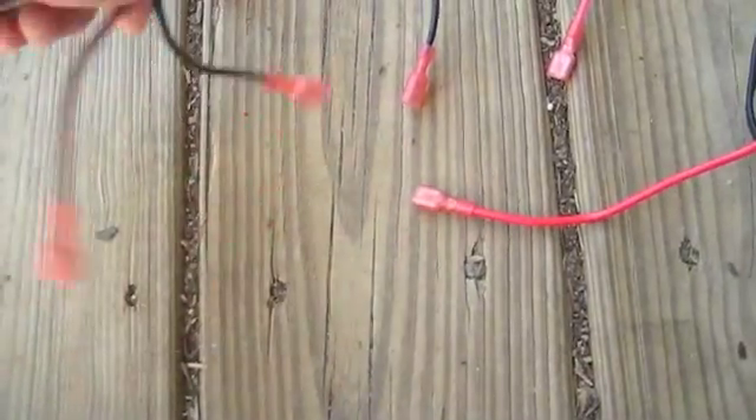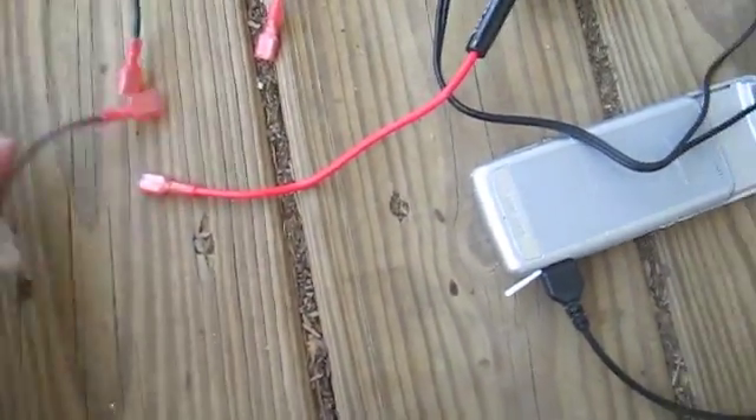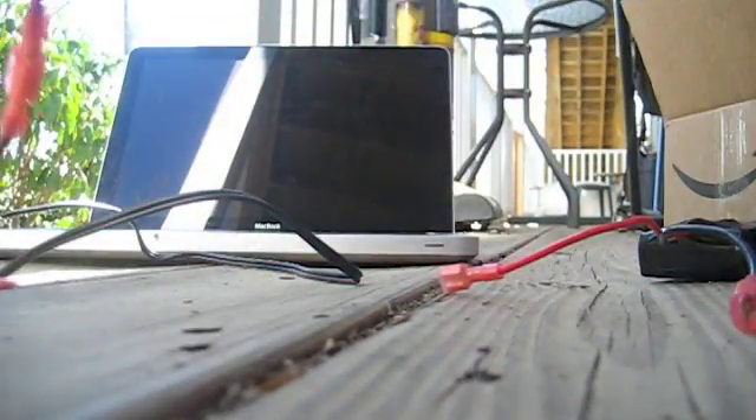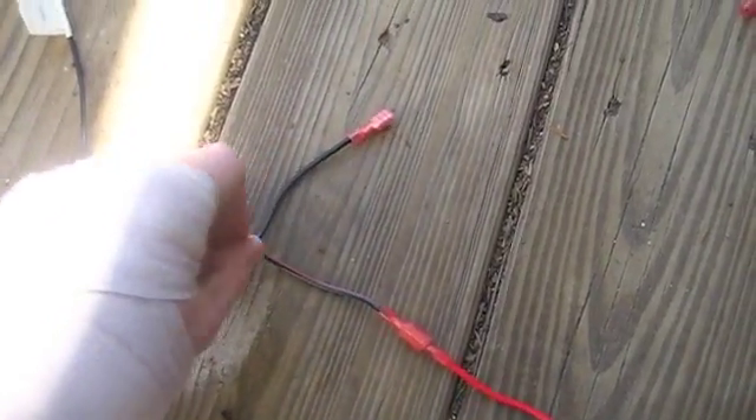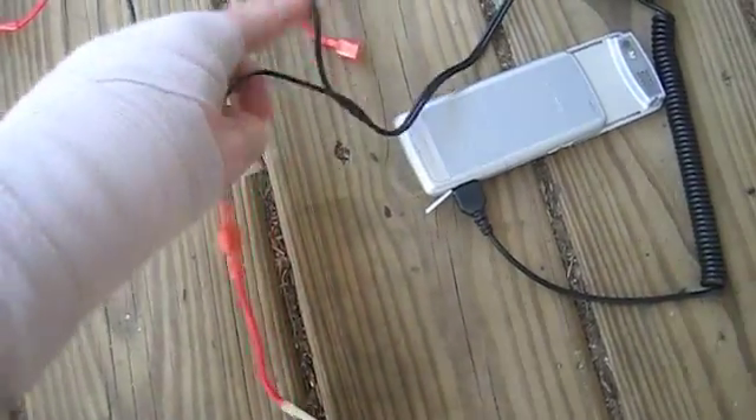Put this together, and as you can see, that's a little pigtail. I'll just split the battery in the middle, still connecting the lead to the next fuse that's going to go to the load. So if you follow my path right here, we're going from the lead coming out of the PV system, through fuse A, which goes to the pigtail that will allow us to split to the load and the battery, then fuse B which is going to be between the load and the power.